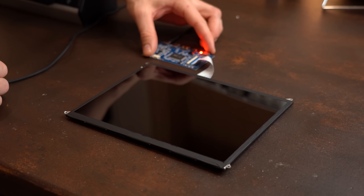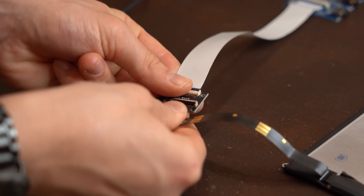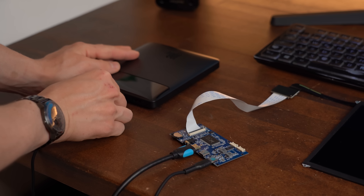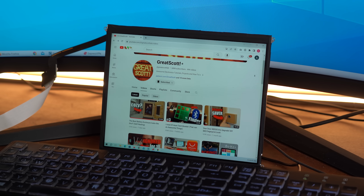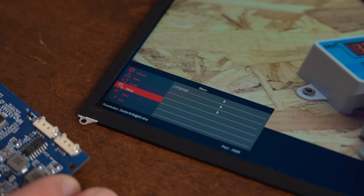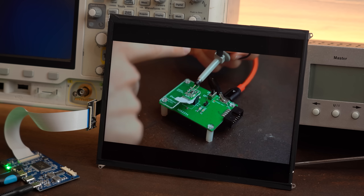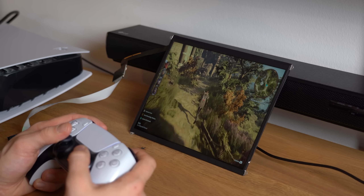Initially I thought my LCD was damaged because nothing happened, but soon I realized I was being stupid and had inserted the flex connector the wrong way around, which immediately fixed the problem. For the first test I hooked the screen up to my PC and powered it all with a power bank. I gotta say this worked beautifully — the whole screen got used, the colors were crisp and vivid, the viewing angle was quite big, and you can fine-adjust the most important settings in the menu. The screen only requires around 1.2A maximum at 5V, and in combination with my PS5 it can also be used for gaming without a problem.